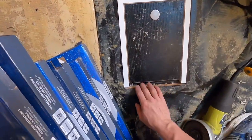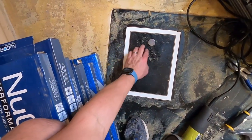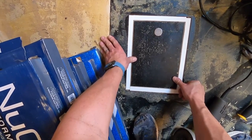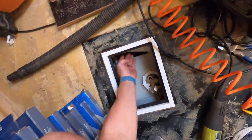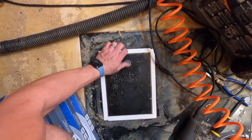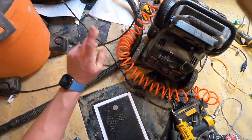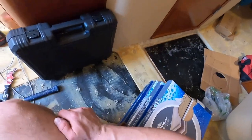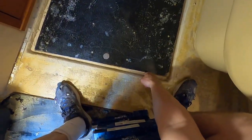This side is fine; this side I need to clean up just a little bit. It looks pretty good — it's really tight but I think that's fine. I don't really want any movement here. Once I nail it it should be good. First, before you nail, check to see if there's anything underneath here — and there's not, so I can nail. That's perfect. I love it. Now I've got one more to do, and then this hatch is going to be a little tough because I have to build it up three-eighths of an inch and then fill it in three-quarters of an inch. So one down, two to go. I still need to put some five-quarter around here.